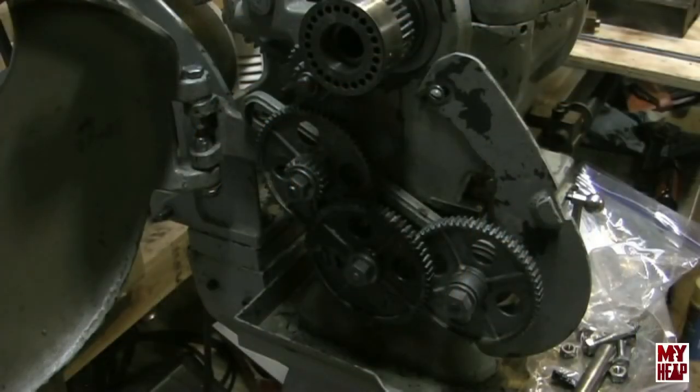Over here at the end of the lathe where the gear train sits on the banjo — I have the banjo disengaged from the headstock — these are all the gears that I have. I don't have change gears for the lathe, and obviously it's not a quick-change lathe. So I can't run it in fine feed at the moment with the gear train. I'm looking for gears or some options for getting gears. I'll be honest with you guys: this is a hobby for me and I've got three kids in college, so I don't have a lot to spend. I'm looking to get going as cheaply as I can.